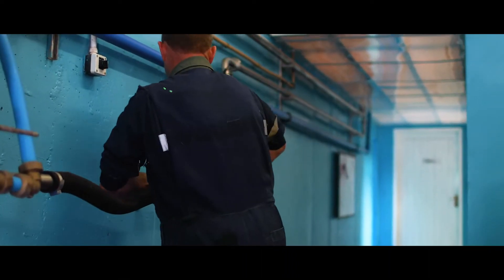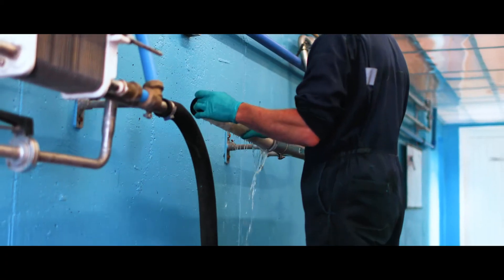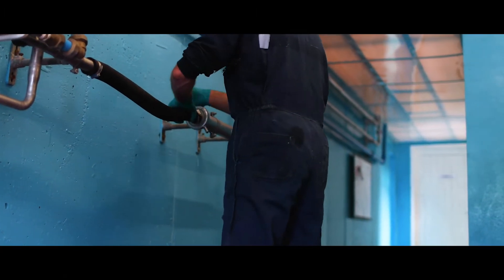Using a clean milk filter for milking is a basic. A clean filter sock being left in at all times during the washing will ensure you protect the plate cooler. Protecting the plate cooler from any fibres, dirt or dust coming through during the wash routine is essential.